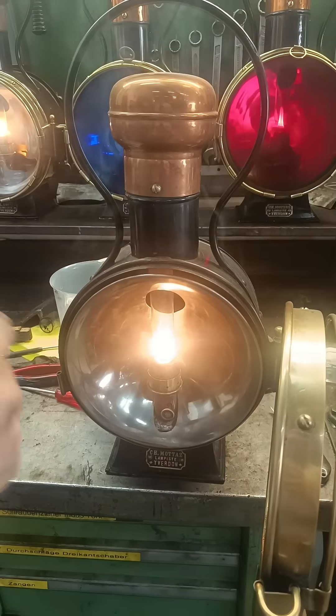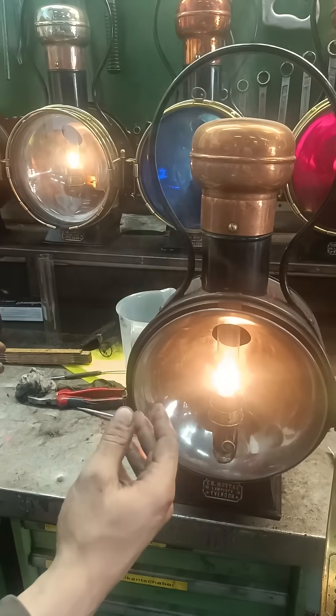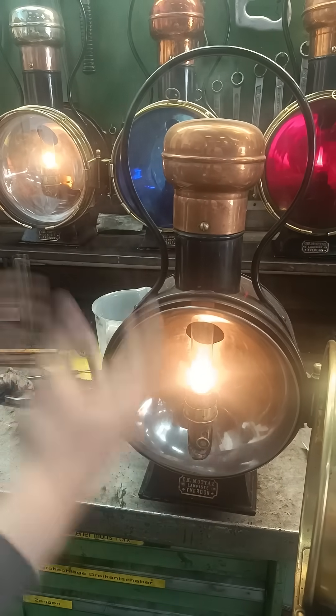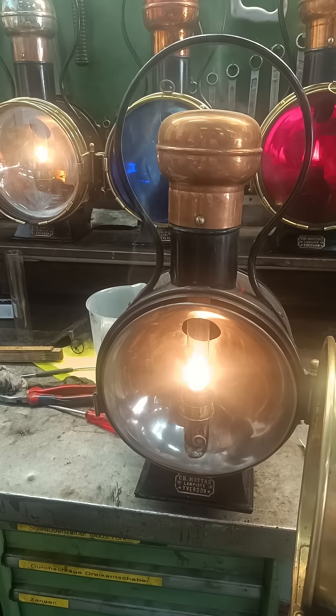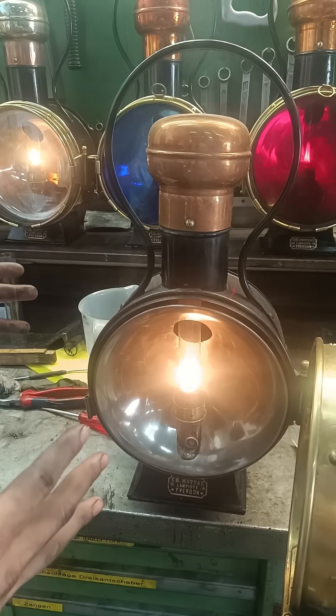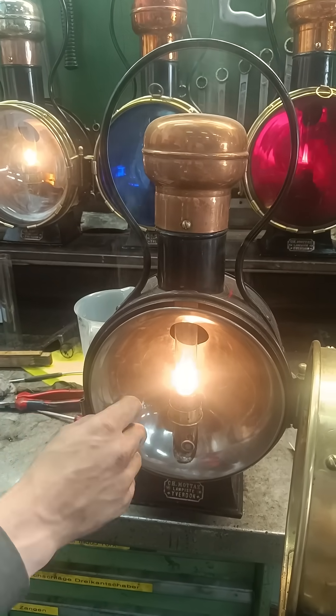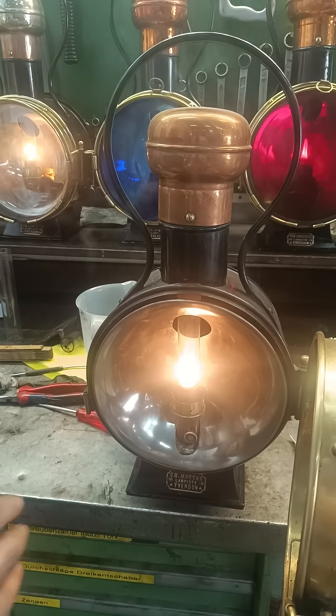A couple of these did it too, but the way you want them running is with the flame a couple of centimeters above the choke neck so that it accelerates the air really, really fast through the burner and makes a nice healthy draft through the lamp. And also heats the lamp up — in wintertime, you'll find it really helps because they self-clean of snow and ice and they don't bog down. If you have them on too low of a fire and you pull out of the shop into a really cold day, some of them will actually self-extinguish.